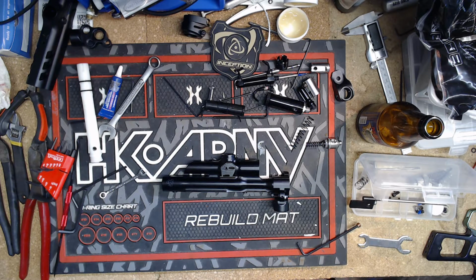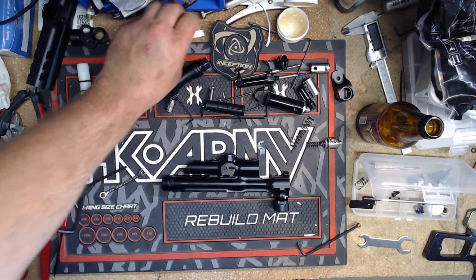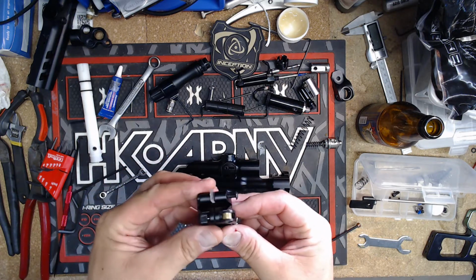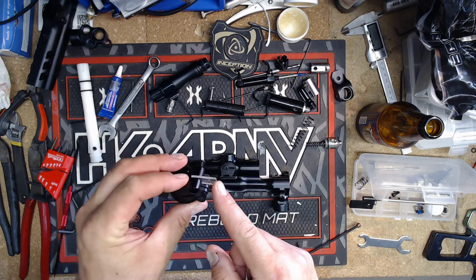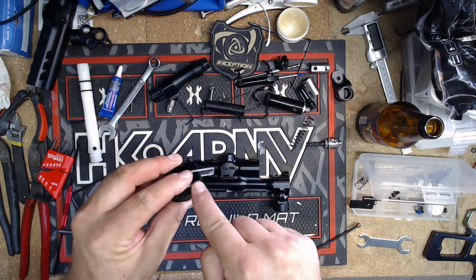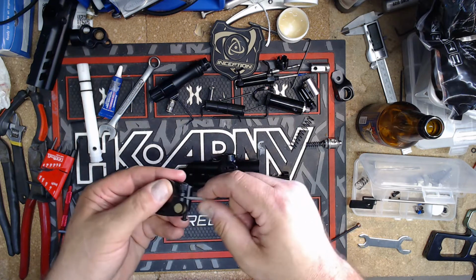Pull this off to the side. Get out of the way. And get all my parts kind of laid out here. So, all right. Actually, let's start with putting the feed neck on, and you see that I'm using a piece of Lexan here that goes in here. I've inverted this screw. It used to feed in this way. I've pulled it out, fed it in the opposite way against this little piece of plastic.